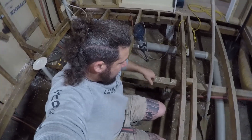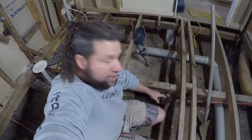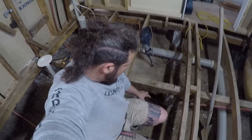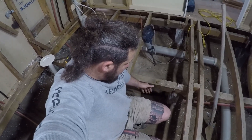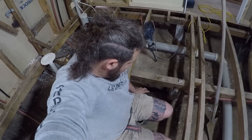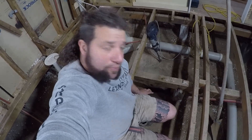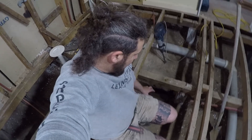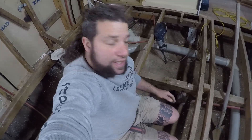I'm doing it this way because we've actually got stumps in both areas and I've got a jack just under the other side of it. So what I've done is jacked and supported it. Then I'll dig this one in, pull that one out and hang this one, and then that's ready to rock and roll. I've filled it with water — I've dug it about 150 mil deep and filled it with water to soften up that soil a fair bit, and that'll make that hole much easier to dig.